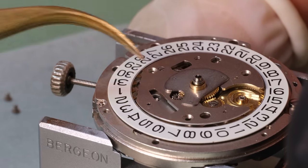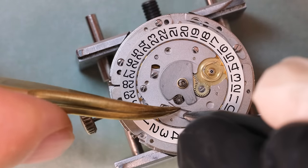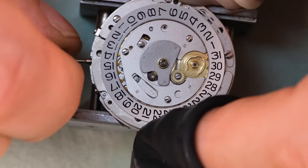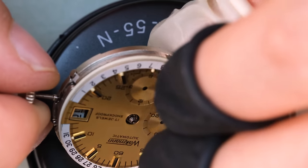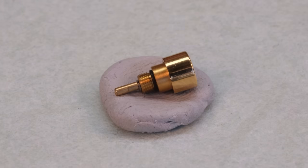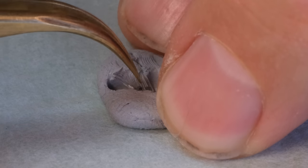We're almost done with the movement — just need to put in the cover plate for the date and the last remaining spring. Before putting on the dial we'll also lubricate the jumper for the date, which makes the date flip over a little more snappily. The dial is in really nice condition — barely any marks. Before putting the hands on we're going to case the movement, but first we need to change the pushers and the crown. For pushers there are typically two ways to secure the plunger — with a circlip or C-clip as on this one, or by screwing them in. Screwing them in is much better and easier.